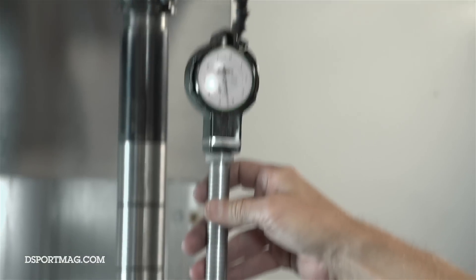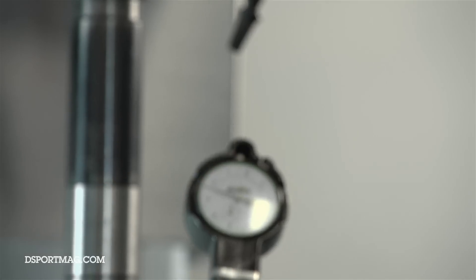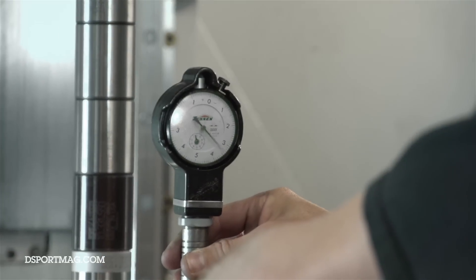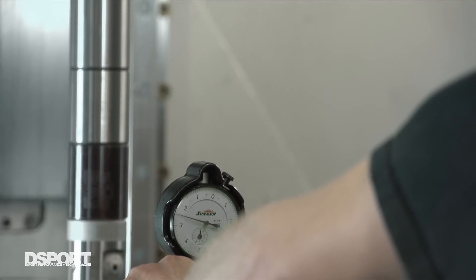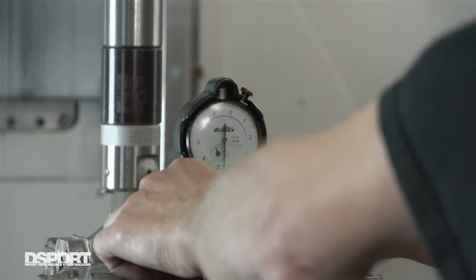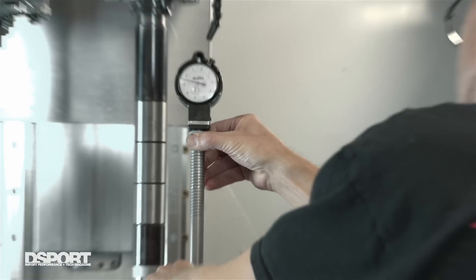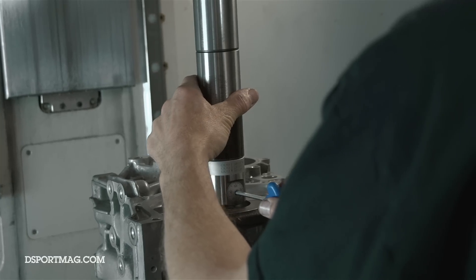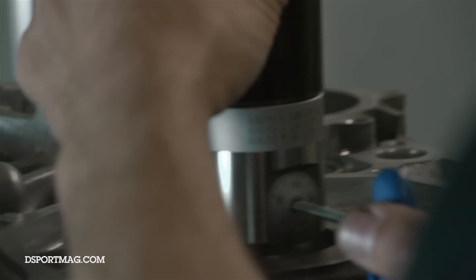It's still about four and a half thousandths that need to be cut, and it's a good idea to check as you go down. That second one there was probably closer to about five thousandths, so it's a little bit tighter than the top one. There's four and a half thousandths on the third, and this variance you're seeing from main to main is basically going to go away as you continue the line boring operation. They're all going to be equal by the time this is finished, within one or two ten-thousandths of an inch. So Magnus has decided he's got four and a half thousandths to go, so he's going to take out one thousandth here and just see how that goes.